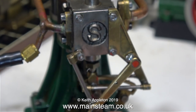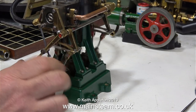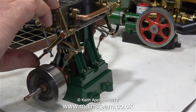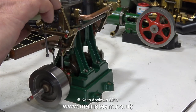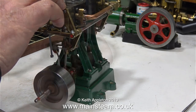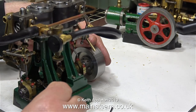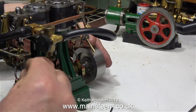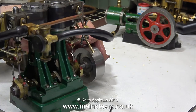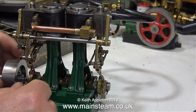Time now to connect the compressed air line and see what happens. Well, it's not bad, but I think I can better this — it needs some further adjustment. One of the valves is travelling too far, so now I'm going back to the other end to adjust the valve, because I don't think it's in exactly the right position. That's more like it — it doesn't sound quite as wheezy and blowy as it did.